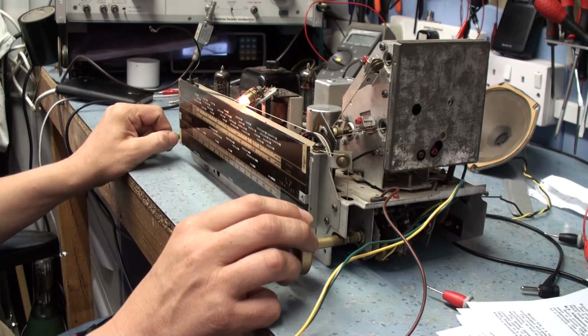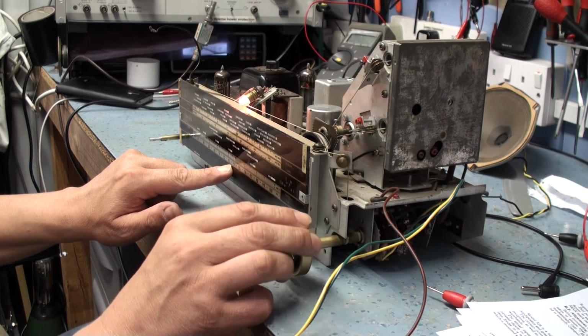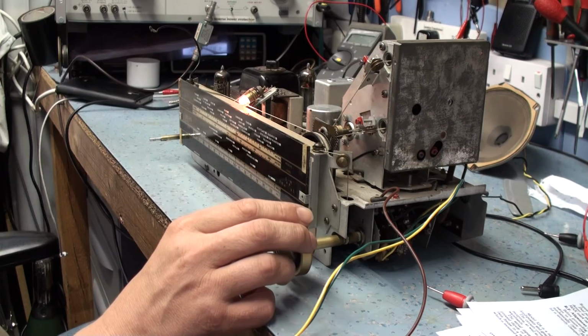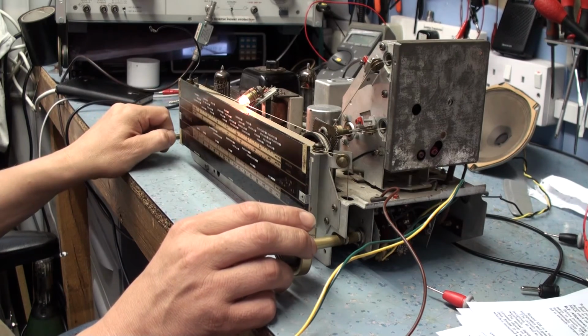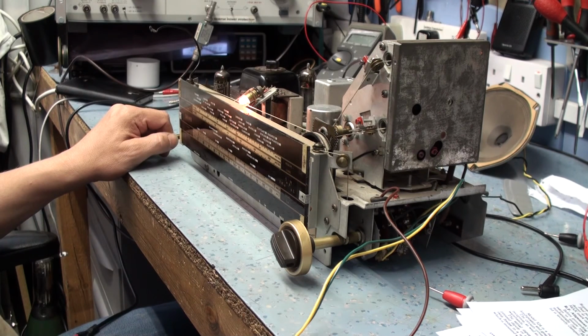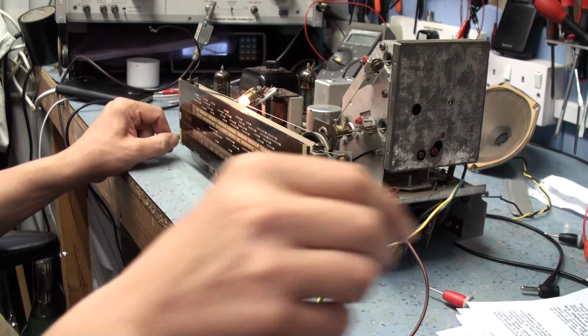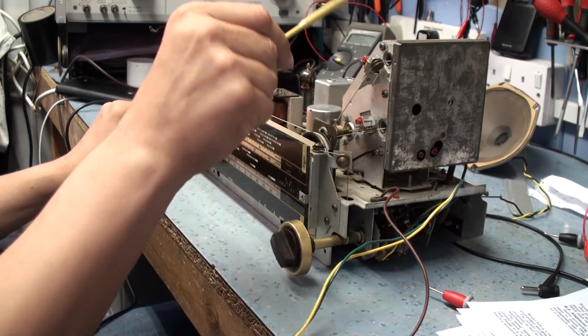You hear, if I tune into Radio 3 on 93.5, the IF gets swamped by something. I don't know if the thing's going unstable on the unit or what it is, but I'm certainly picking up signals now. The RF amplifier is definitely working now. But it's incredibly microphonic as well. I've never heard a radio so microphonic.